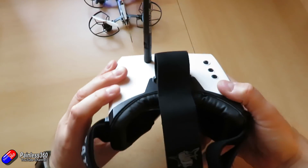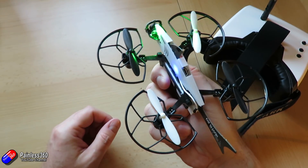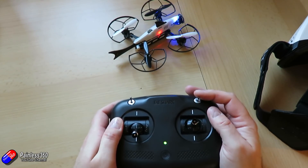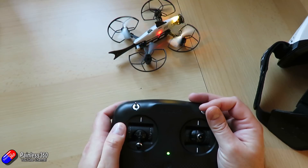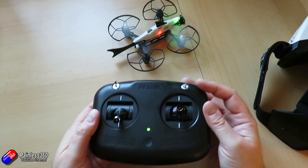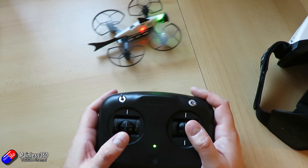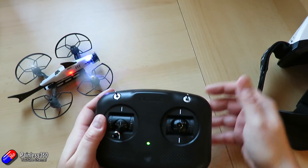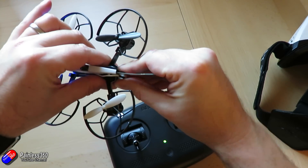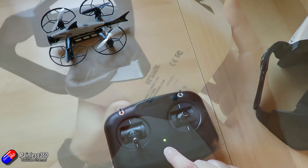The image is quite nice at night when it's flying. Let's quickly arm the motors — if it doesn't arm probably means your throttle isn't in the lowest position, then to take off you just increase the power. To turn the motors off you just flick the switch again. Lovely and quiet actually in operation, so you could fly it in your back garden without getting into too much trouble.